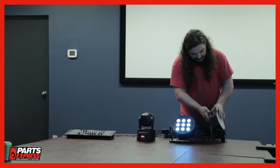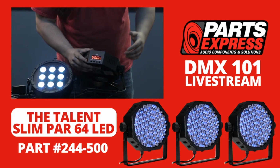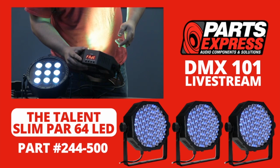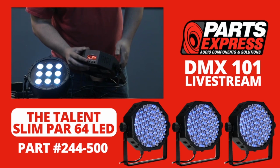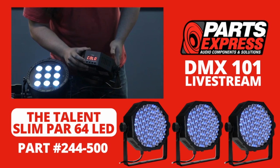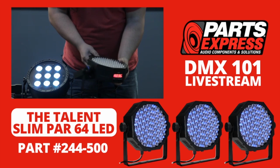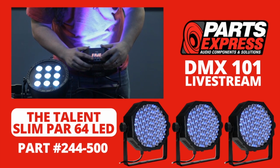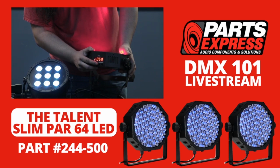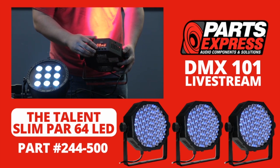Same thing with some of these lights. I can scroll through, there's my addressing. I can set it to a master-slave mode, select how many channels I want it to do, or set it to a sound mode. Jump, which I can change the speed of. Fade. Auto, which is basically the same thing as fade. Some of these, I think they call it nano on this one, let me make my own color. It's plugged in to DMX, so it's just going to keep going back to DMX. But if I go to nano and hit enter, I have R00. I can start bringing that up and mix my own colors straight from the light. So if you didn't want to have to deal with DMX, you can make your own colors from that.